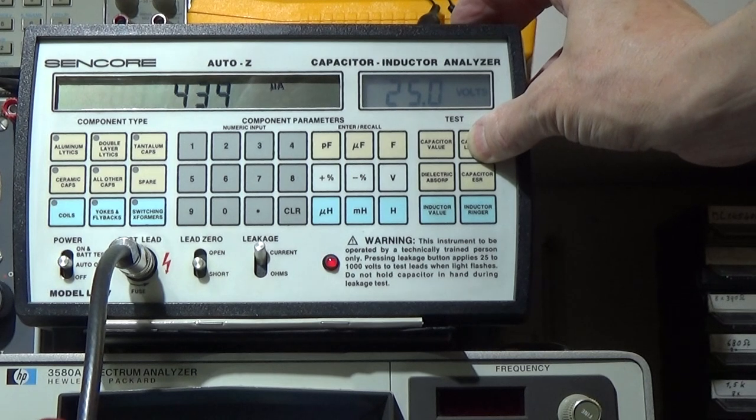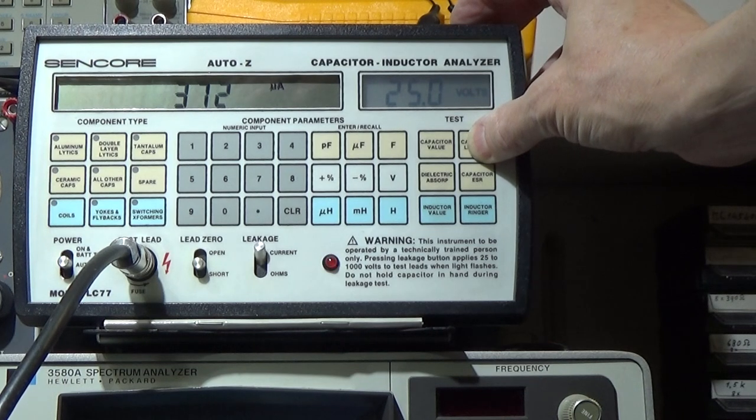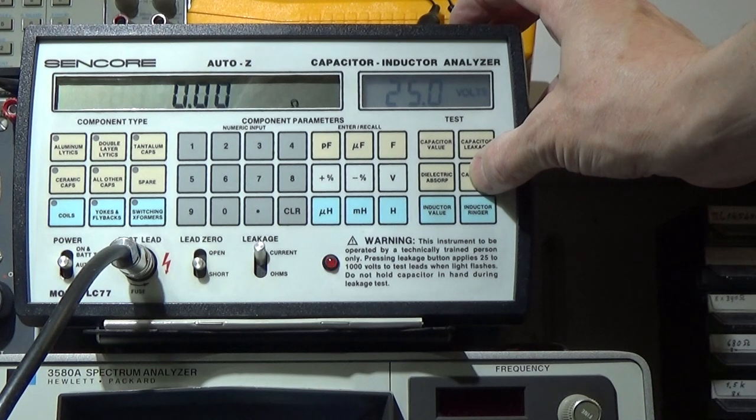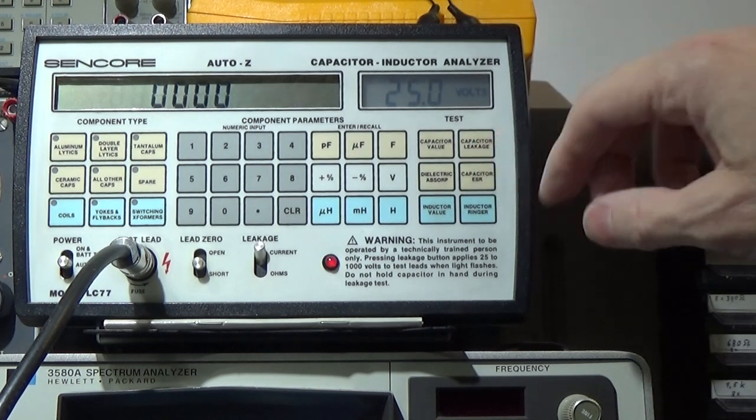So that is now a little bit of reforming the capacitor. You may know that electrolytics can get reformed, and of course, if I put the allowed voltage to the capacitor, it will at the same time reform the capacitor. But of course it needs to go lower, and we do not have the time to wait. It is already quite a long time that we do not have a result. But anyways, what we can say is that this capacitor at the end is not too bad.